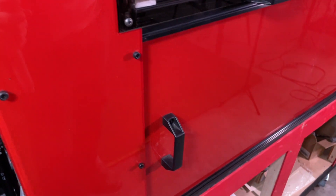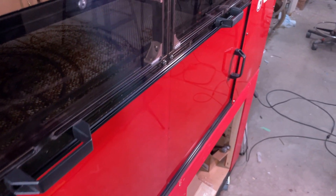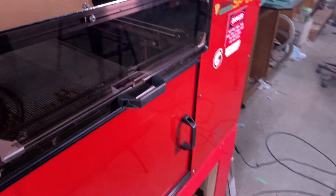You don't have to use clear acrylic. You could use eighth-inch MDF, which is really cheap, or Coroplast — there are a number of materials. Don't use cardboard because it's flammable. But if you don't have the option of taking your laser outside, you might want to cover the dangerous pieces with cardboard temporarily so you can get some suction from the ventilation fan to evacuate fumes, and then replace that temporary covering as you cut proper pieces.